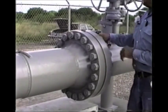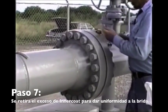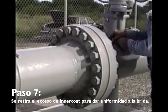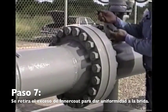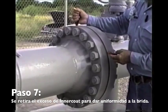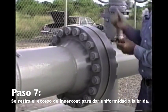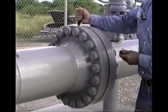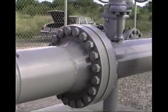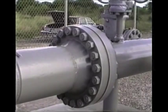If you have a little residue left at the top, take a knife and shave it off smooth. Give it a little bit of finish using a small plastic stick with a radius on it. Just drag it right through the top where you cut the wax off to leave a smooth finish without any cracks. The flange is complete and ready to go.